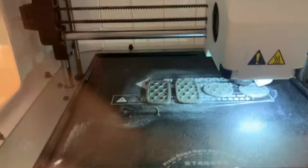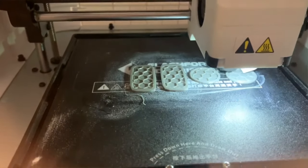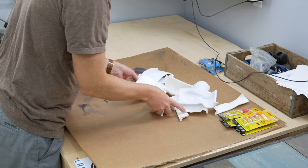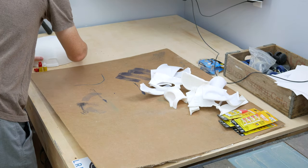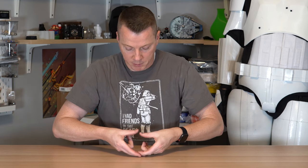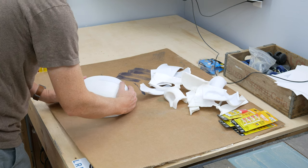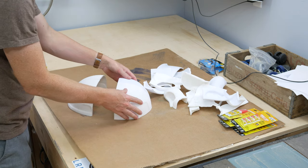If you've got a medium-sized printer, you can print this in multiple pieces and put them together. The helmet I printed, because I didn't use a really large printer, was actually done in 19 different pieces — that's how the model comes so you can assemble each one. None of the parts are more than about this big. On this helmet you can see lines where it got shot and started to come apart a little at the joints — that shows exactly where all the pieces are.